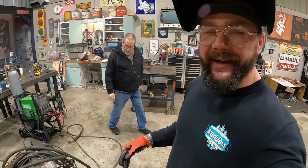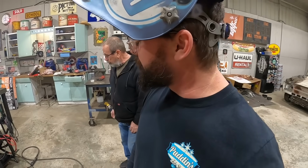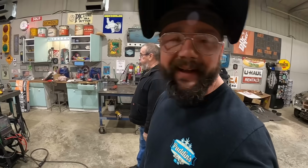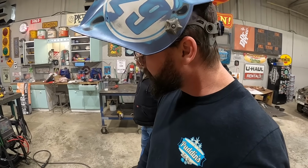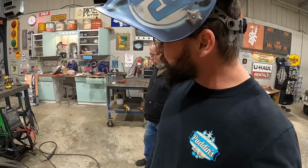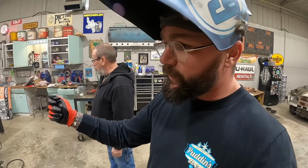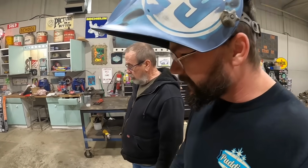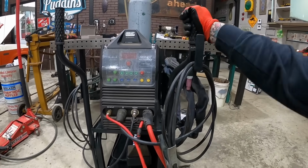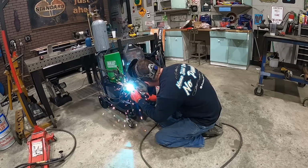The way that stuff radius is in, it's kind of hard to get in there to clean it good. So I've got the welder cranked up. Yes, I'm just stacking tacks. That's fine though, guys, for what we're doing. That heat will help burn that. I don't even know if that's powder coat or if it's alleged to be. Anyhow, you can burn through that stuff quick and hot. Tack, tack, tack. She don't look the best, but she don't look the worst. But it dang sure stiffens it up a lot.